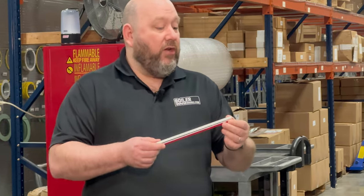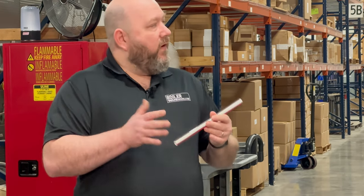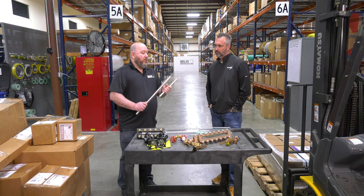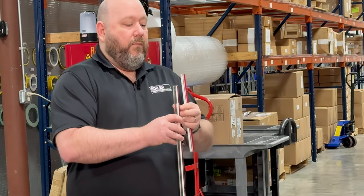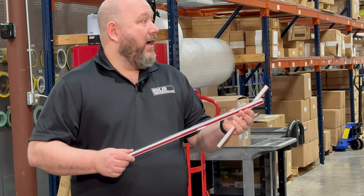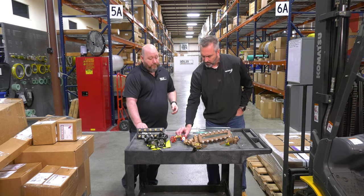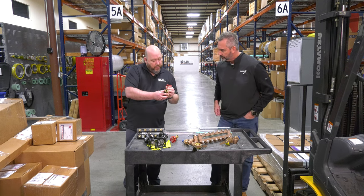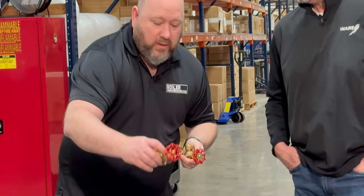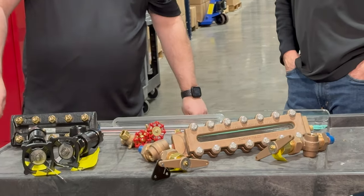This one right here is about three thirty-seconds thickness, which is good. The pressure and temperature ranges change with the length of the glass, so for most small glass situations these are rated around 250 psi. We also have a thicker version that is basically double the wall thickness, but that only changes the pressure rating about 100 psi, so about 300 psi max is what you'd want to use these on. These valves right here should have a pressure rating stamped on them — these are 250 psi rated — and we also have some United Brass that are about 250 psi rated.